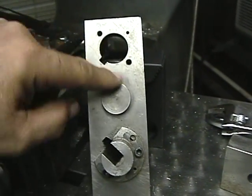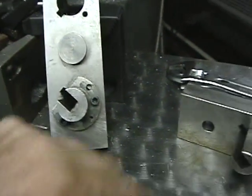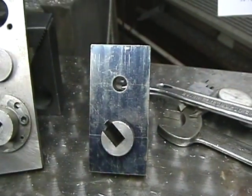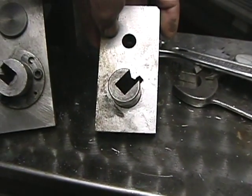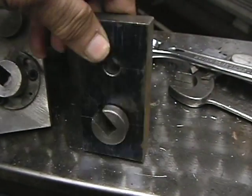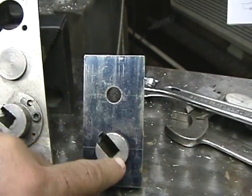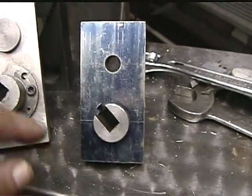On the other end of the jig is a setup for another locomotive — I think it was an Allen Mogul — that used the same crank pin. I just had an extra piece on the jig for a different setup. This one over here is made up for the 040 Camelbacks, which has a 7/8 or 1-inch bore in the main axle, a 7/16 crank pin hole, and a distance of about an inch and a half.